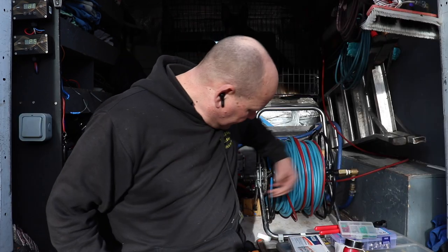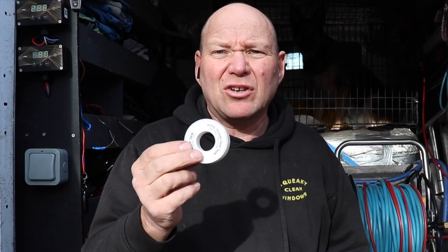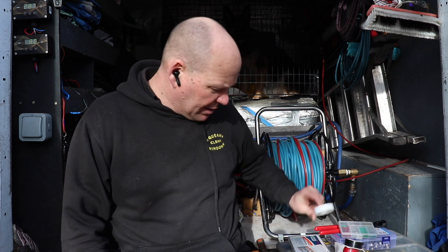Talking of tape — PTFE tape. If you've got a dodgy connection somewhere, roll some PTFE tape around it, a few wraps, tighten it back up. That normally stops most leaks, so it's a brilliant thing to carry.